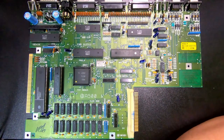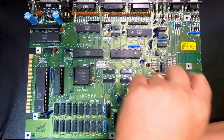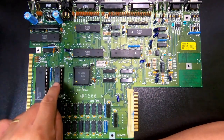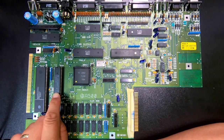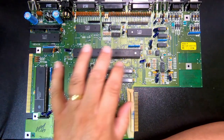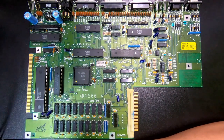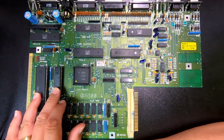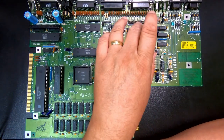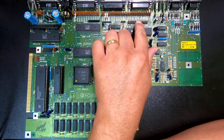So that's all the main areas and main components. You would wonder — you have a processor and a custom chipset, so where's the code? That's in something called a Kickstart ROM, and that's this chip here. This contains all the so-called Kickstart program code. When the processor starts, it starts executing code from here and distributes all the stuff to needed sub-processors, boot up mechanisms and so on. When it's loaded this code, it will ask to load a so-called Workbench diskette on the display, which will be loaded predominantly from this disk drive.